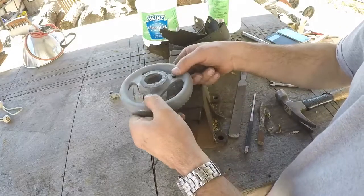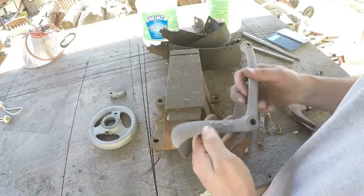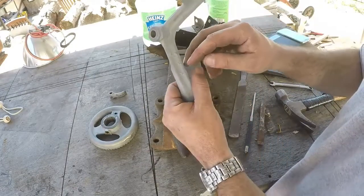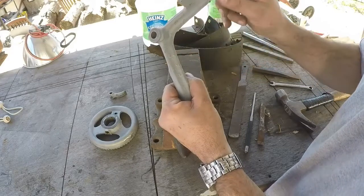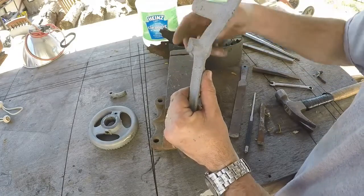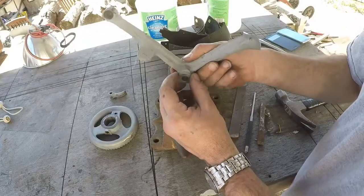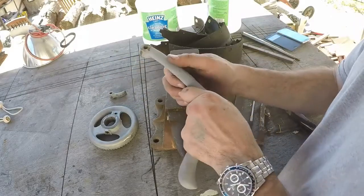That's not too bad — I think that'll probably work. Now this cam piece here has got a lot of stuff to work on. See all the little bumps? This is what happens when a little bit of sand falls out of the mold — the metal goes in and fills in that little hole, so you end up with really weird bumpy textures. There was another piece right here where a big piece popped out when they were working on it. That's all got to go, because if we mold this up in sand it's going to rip all the sand out when you pull it. We'll get here with the file and then find the Dremel and work on it a little bit.